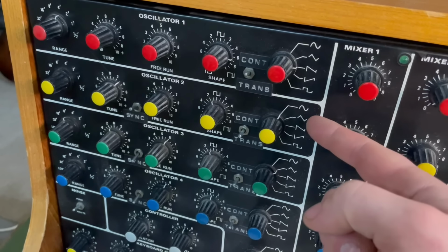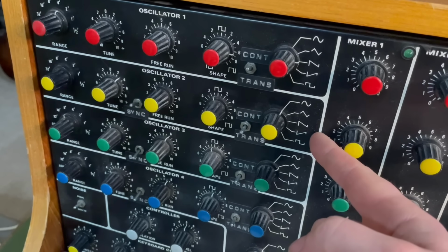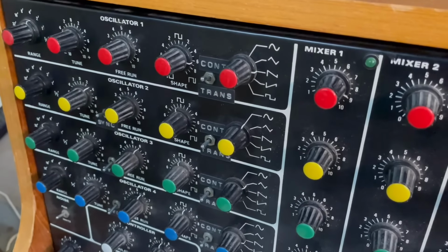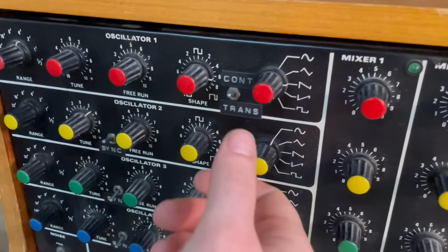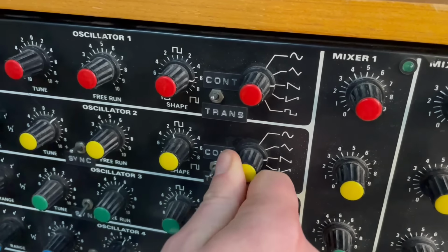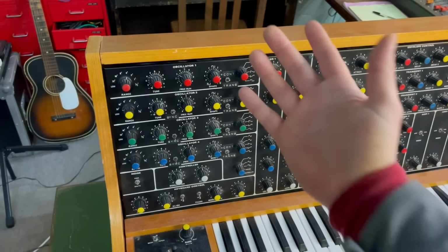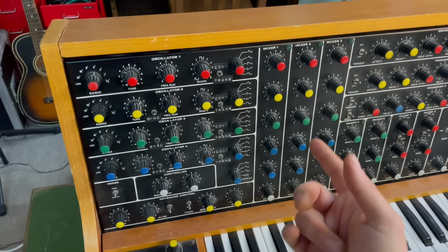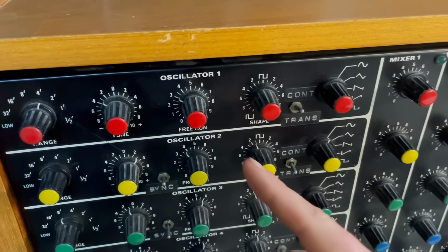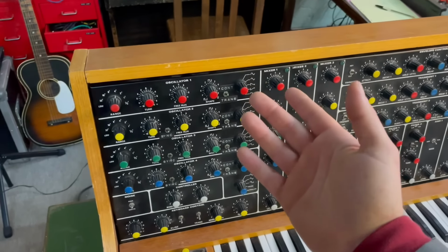Wave shapes are like the character of the sound, the timbre. So you've got sine, triangle, ramp or sawtooth, reverse sawtooth, and square. And you hear they get harsher in sound. So that's the sine. What we perceive as sound is just fluctuations in pressure waves in the air, and the more fluctuations, oscillations, per second, the higher in pitch we're going to perceive that sound as.